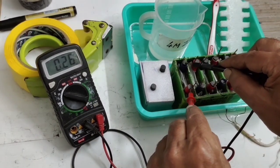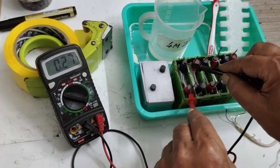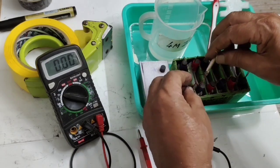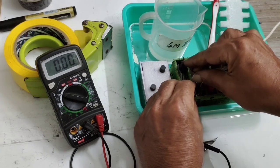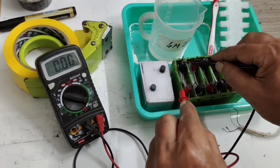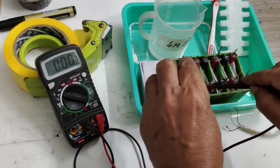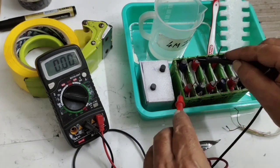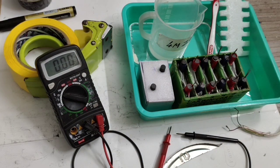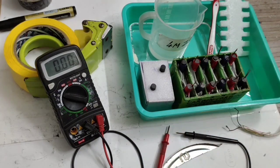After adding the electrolyte zinc chloride, the basic voltage it is able to give is 0.27 volts. So I am going to charge it in front of you using 4 volts DC. After charging, it is showing 1.83V. The second cell shows 0.3V initially. After charging, similarly it will be around 1.8 to 1.7V, slowly reaching up to 2.1V. Similarly I will charge all cells and see how they are working, then close it, give serial connections, and see what the final output is.